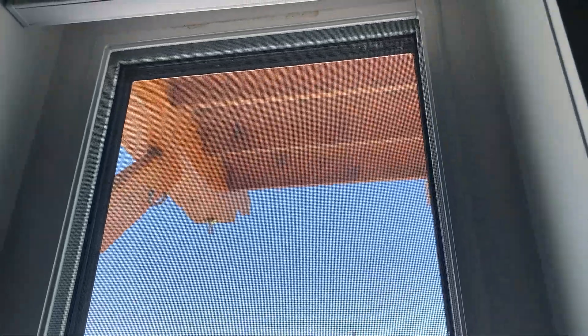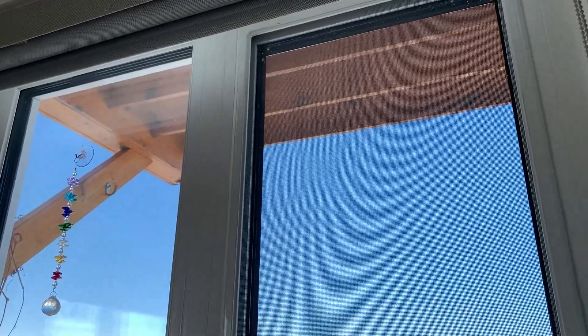You don't want particularly large windows on any other side of the house but the south — just enough for some natural light and ventilation. You do want some windows on the west side so as the sun's going down and setting, you're getting some warmth in your house before it gets cold at night. You can even make shading devices to protect windows from the hot summer sun, like one I made on one of my west windows. When selecting windows, I'd suggest not getting the low-E coating, because you want as much winter sun as possible in your passive solar house.